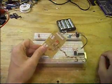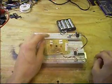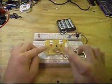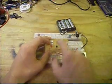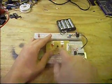It's just a simple logic tester. It can measure low and high logic outputs, and it also has a float feature where both LEDs turn on when it's floating or not connected. It just consists of two red LEDs, an NPN transistor, and two 1k ohm resistors.